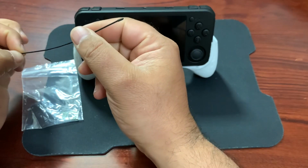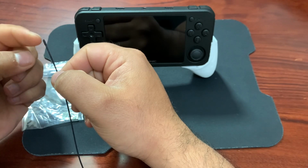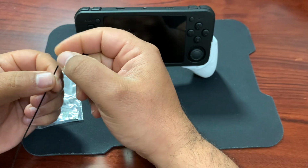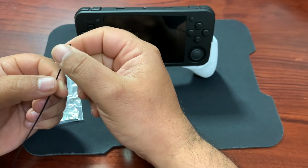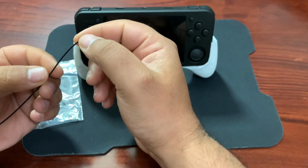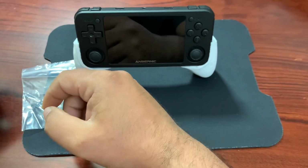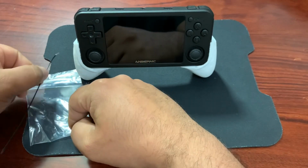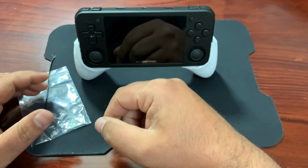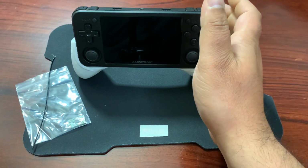I've got this little antenna, which is from just a standard laptop coaxial cable. I put some thermal shrink tube on the end to close it up, so it's literally the center coaxial cable with the screen cable on the outside. The idea is that I'm going to be soldering this directly to the board, and then the contact pins on the chipset will go onto the contact pins of the RG351, and that's it really.